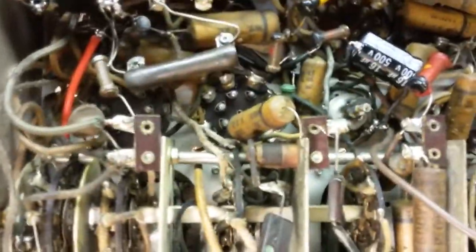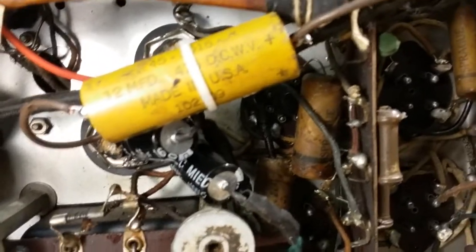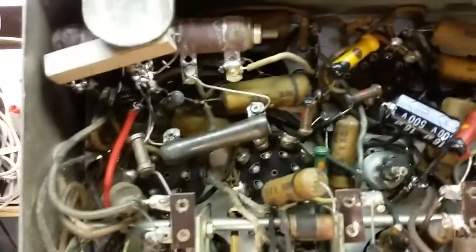It'd just be interesting to see how the Silvertone is holding on with its original wax caps in place. Of course, we would not let it draw any current because we wouldn't want to hurt anything, but just to see how it's doing. I wouldn't be surprised if it fired right up. Most of these antique radios do, unless there's an actual short, in which case that's what the current limiting bulb's for. It won't let the unit draw more current than needed, and of course, with eyes on, you shut it off right away if the current gets too high.